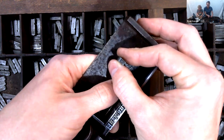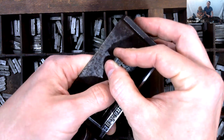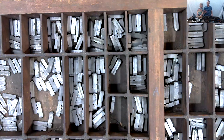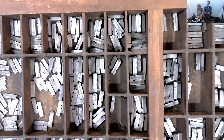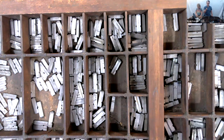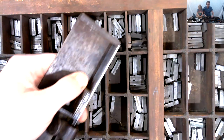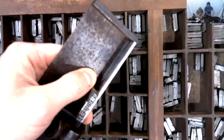'Mind your P's and Q's' — you need to do that because even though you know you're working in mirror image, your brain will tell you 'that's a Q' and you'll put it in the wrong place, either when setting type into the stick or when putting type back in the case. Inevitably when we print a proof in the shop, we will see some backwards B's and D's, which look like each other in mirror, or P's and Q's.